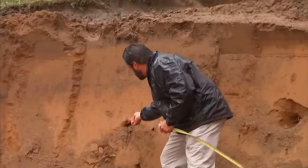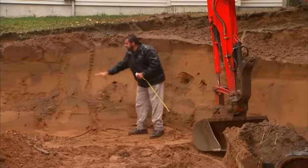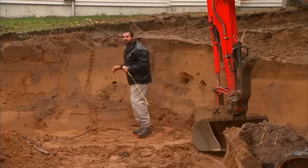We're also very concerned about this root matter that's coming through the face here. We've got to get all that cleaned up and pulled out of here. So our next cut is going to be three feet back at a five-foot elevation.